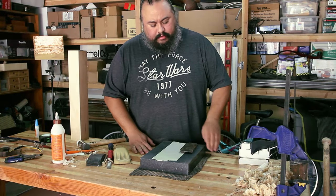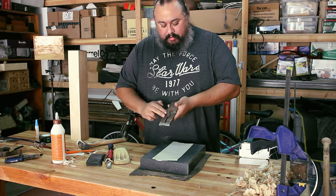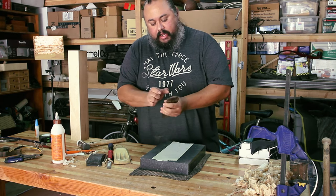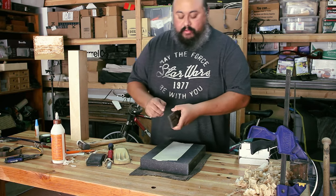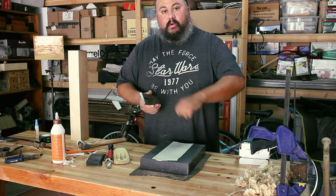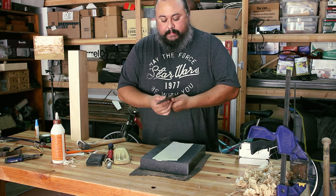While things are drying, I thought we would start working on the iron and chip breaker itself. I still have to de-rust it, and once I do, I will be polishing it and seeing how bad it really is. One thing that's been bugging me is the chip breaker seems to be a hairline wider, probably a good 32nd, maybe 64th of an inch wider than the blade. When I put it into the plane, I feel like it's catching, because the side is thicker than the throat. So I want to sand it down flush. I've got one side flush, and I'm going to sand down the other side flush